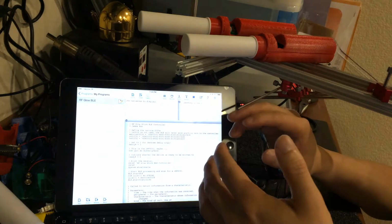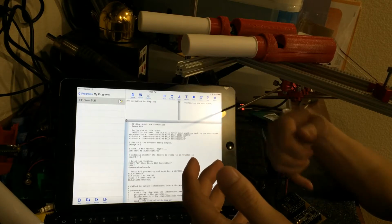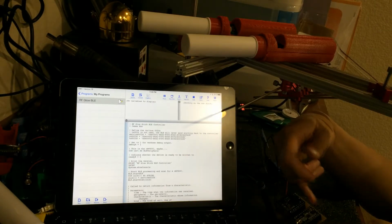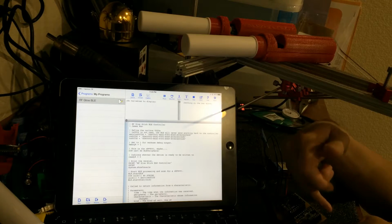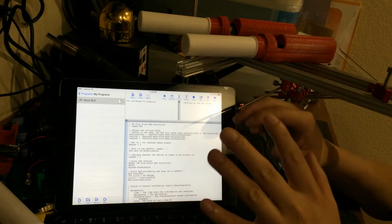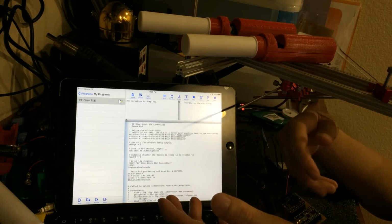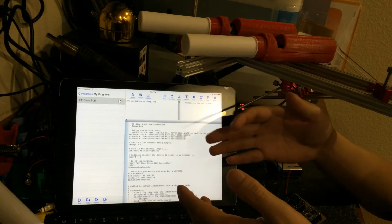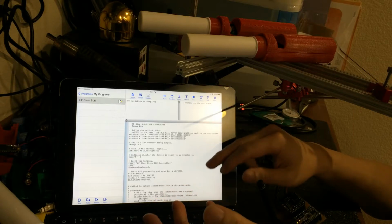So when I iterate on what is the right speed for me to send commands, so I don't overwhelm the modem, right? Because the modem runs at 9600 BPS. Bluetooth is about 3 megabits per second, so the Bluetooth interface is way faster than the serial modem. The serial modem right now I've tuned to a 5-byte payload size, so it takes about a 30th of a second to send. There are some timings that I have to work out with the real devices, but it's easier for me to iterate here in TechBasic. The principles and the APIs are very similar.